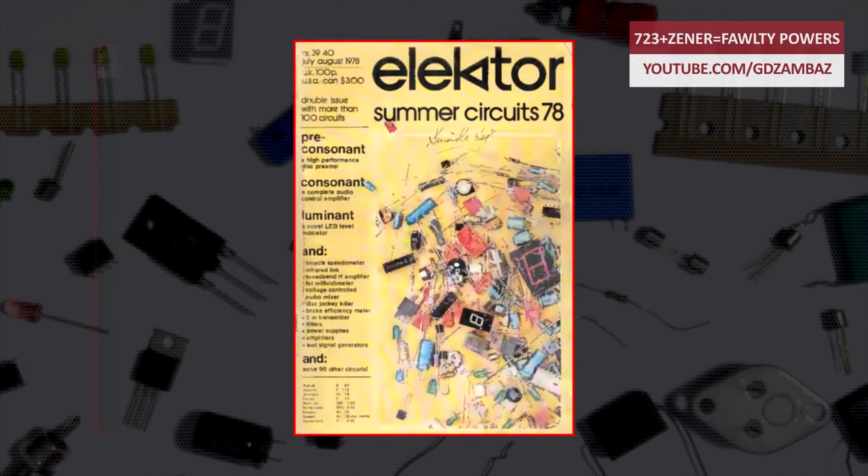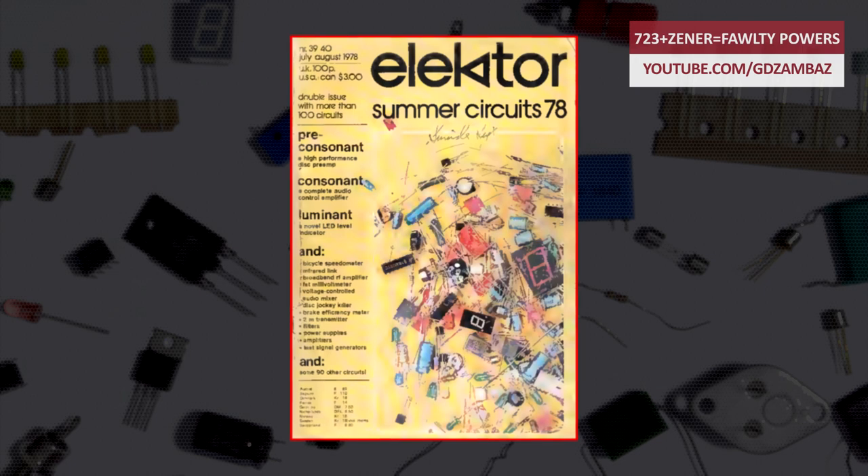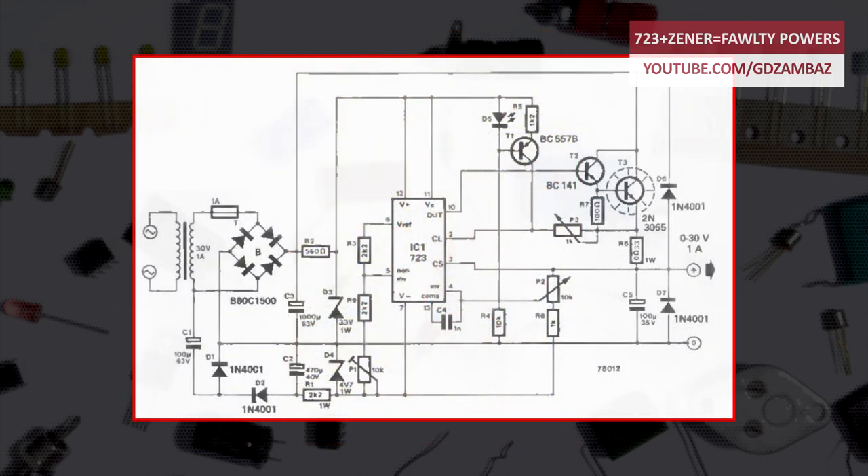This schematic comes from an old article published in the July–August 1978 issue of Elektor magazine. As you can see, instead of being connected to the 0 volts rail, the V-minus pin and the two lower ends of the voltage dividers are connected to a negative supply — nothing more than a simple regulator with a Zener diode. The idea is that by pulling V-minus to a lower potential, the inputs of the error amplifier can go lower as well, provided that the voltage between them and V-minus is not less than the minimum required 2 volts. In this configuration, V-minus is at minus 4.7 volts and in steady state both inputs are at 0 volts relative to the ground rail.